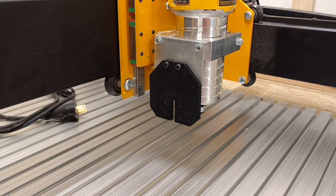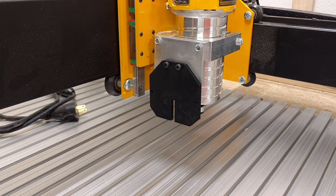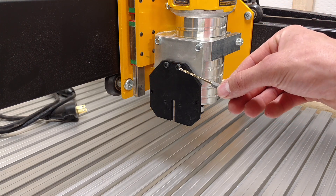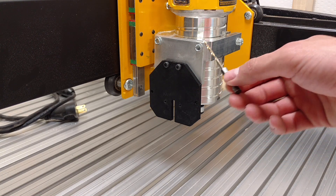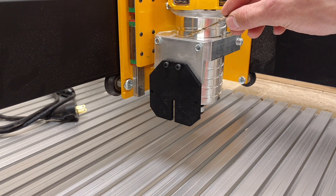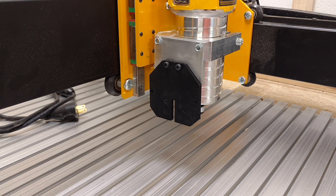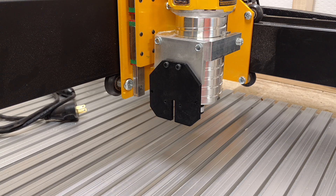As you can see, there are just two screws that hold this magnetic bracket onto this aluminum bracket, and this aluminum bracket I've mounted to the router mount here. I used this bracket for a couple of reasons. Number one, the screws that came with the laser mount were too long — there wasn't enough clearance. If I would have drilled and put them in right there I would have gotten into my router. And also those screws are kind of small — I wanted something a little sturdier.